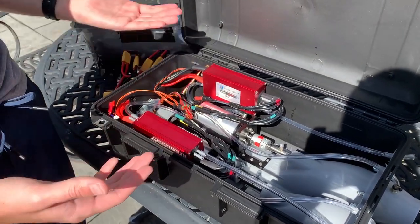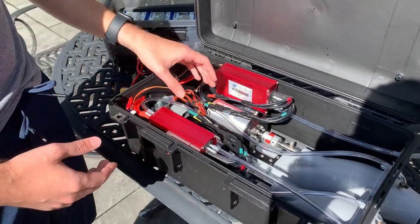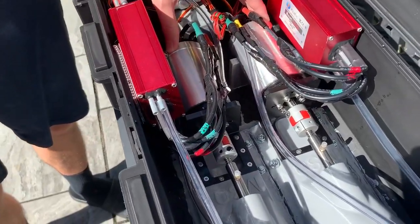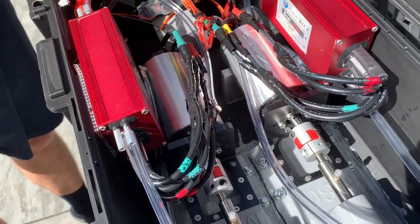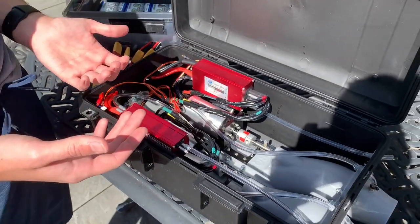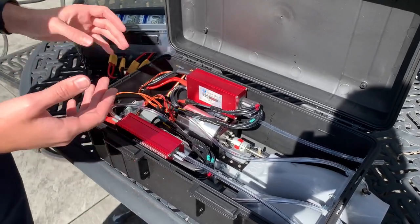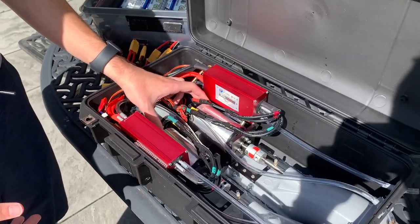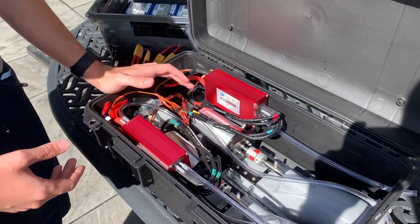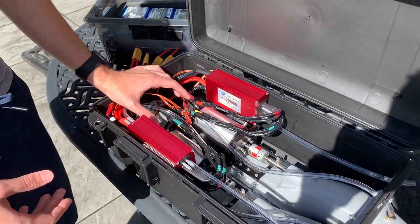The next are the motors — two SS-S56-123s, 230 kV each. They're maxed at around 155 volts, so 15 kilowatts max. I'm only going to be running them at around 4.5 to 5 kilowatts each, so around 10 kilowatts total.